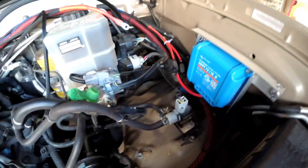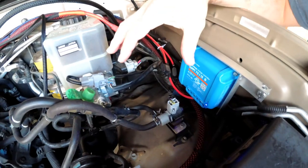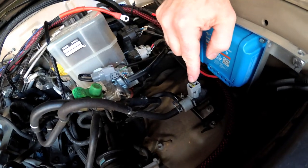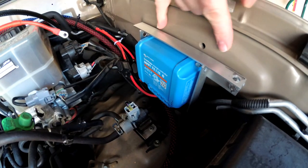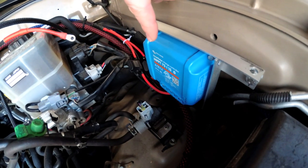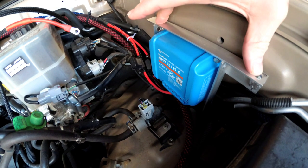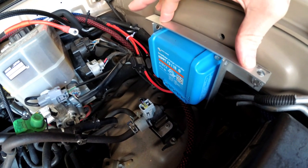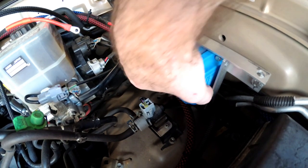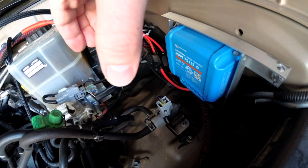I'm ready to start working to install my relay box. I had seen one other person install an S-Pod right here on a bracket that's gonna sit right above this little electrical fitting and mount up against this side wall on the quarter panel. Currently I have my solar controller mounted there, so what I'm gonna do is use this existing mount, mount the brackets that came with the relay box onto it, then mount my solar controller flipped up directly on top of my relay switch box.